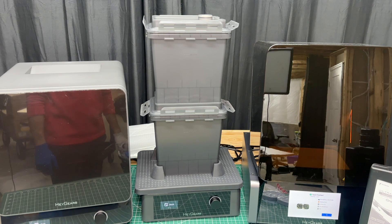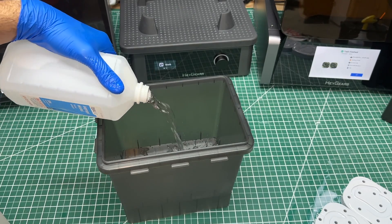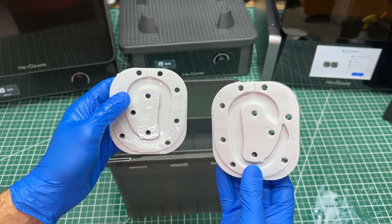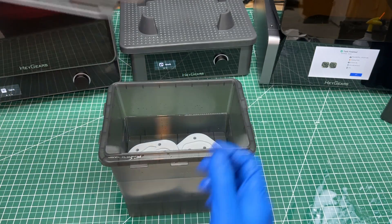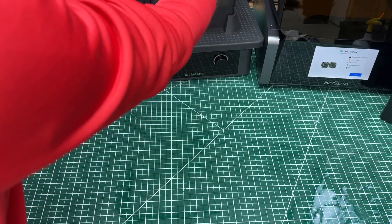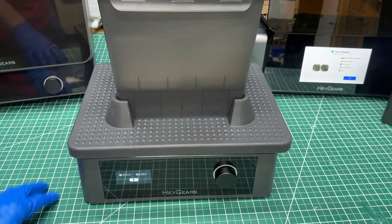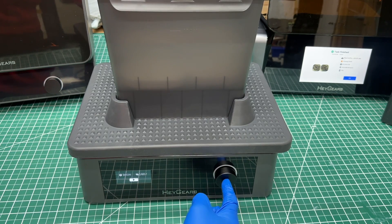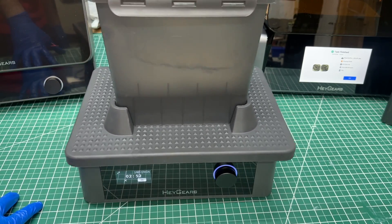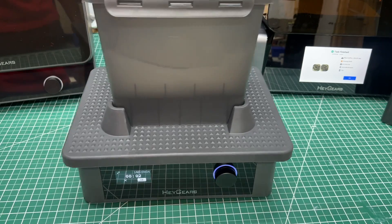The washing station comes with two tubs, but we really only need one of them to do the initial wash. I'm going to remove the top one and fill up the bottom one with isopropyl alcohol — it takes about three one-liter isopropyl bottles to fill the tank. I grab the two dirty sides of our molds and drop them inside, then cover the tub with the lid. I was a little worried the station would vibrate the table like crazy since it juggles the whole tub left and right, but it's surprisingly not moving around. It's very vigorous mixing, so I have a feeling after three minutes the parts are going to be very clean. This method is actually seeming very reliable.